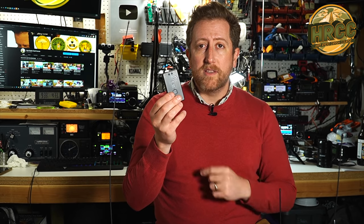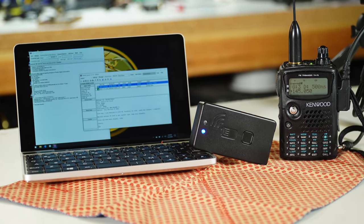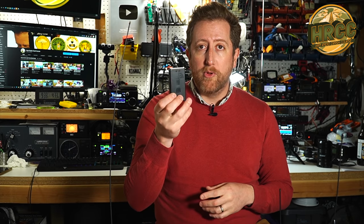With this you can bring audio into whichever device you like, so long as it has Bluetooth. Simply pair your radio to this device via the cable and then pair it to your phone — that's all there is to it. You can start working TNC-based modes like AX.25 packet and APRS. One of my favorite things to do is connect this to my radio and laptop and do Winlink email over packet radio — a really cool portable device to carry along, letting you connect to email when you're out and about without an internet connection.